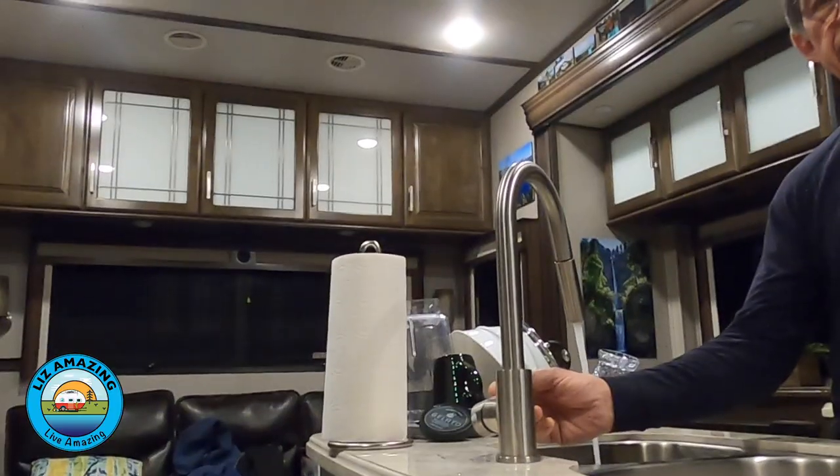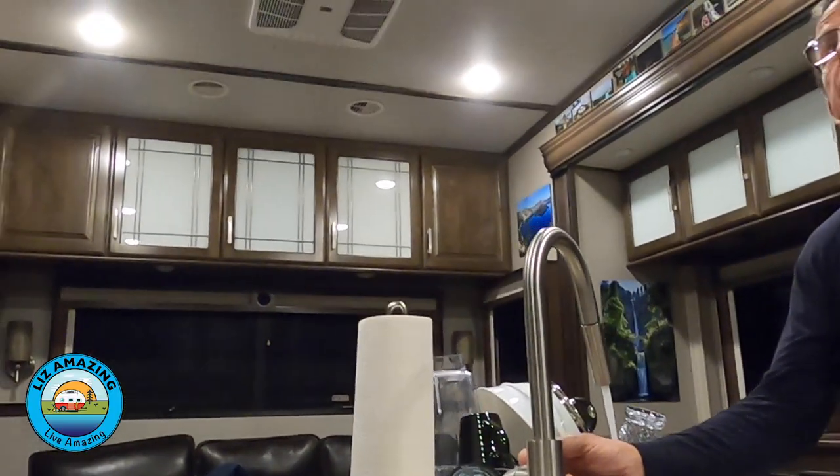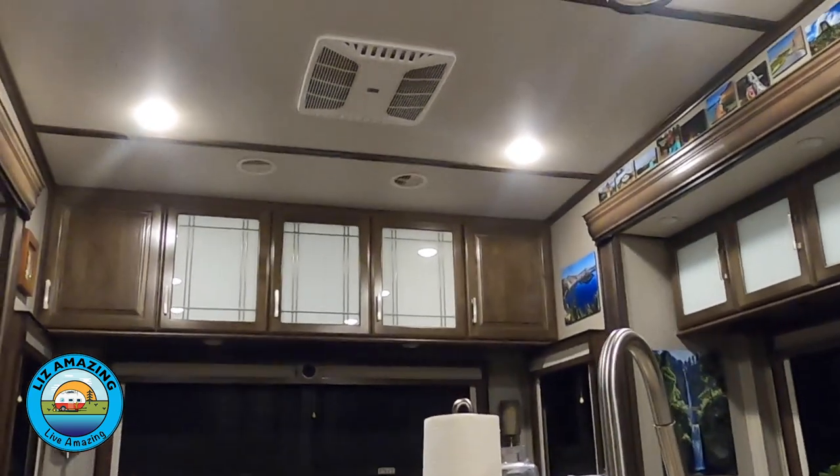The difference with dry camping is that we're using the water pump. We're dealing with the fact that we don't like the flashing lights — nobody would like the flashing lights. The room lights are LED and 12 volts, and the pump is also a 12-volt circuit. Step one was to check the battery voltage, because if the battery was low it would strain — like when you start a car with a low battery, the lights dim.